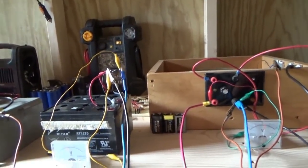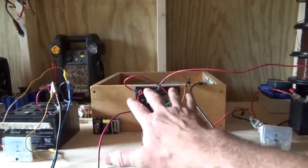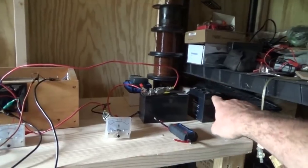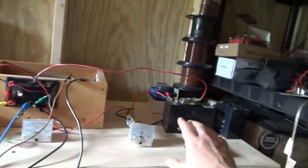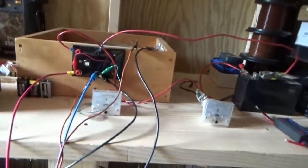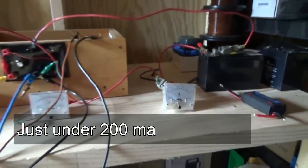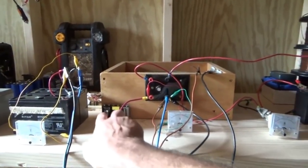These two batteries are now going on six volts. This has been off overnight, I only just turned this on a few minutes ago. I had it going for a bit but it was fluctuating a lot when I added the third set of batteries. I put a more stable, brand new battery on and it was still fluctuating really crazily. So I switched to analog - we're just under a hundred milliamps. The analog meter nicely averages out what's going on.